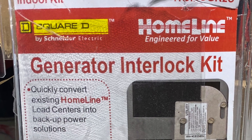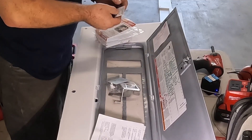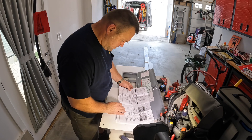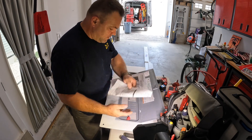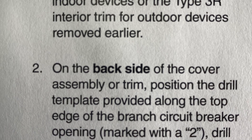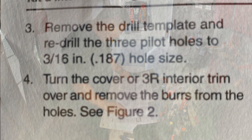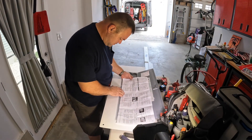This is the listed mechanical interlock for this particular Square D Homeline electrical panel. I cannot stress enough how important it is to read the directions before installing this manual interlock. I've installed dozens of these before and I always re-read the directions so I don't make any mistakes. They'll give you a template — line that up on the back of the panel as the instructions say, then use a 3/32-inch cobalt metal drill bit to make your first holes, then larger holes using a 3/16-inch metal drill bit. Read the directions for the orientation before you jump right in.